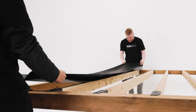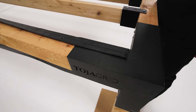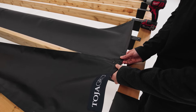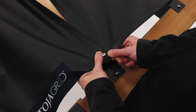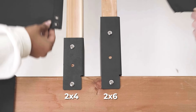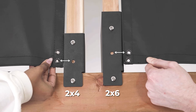We are starting with the left side panels. To fasten them, attach the corner magnets to the trio brackets and overlap the corners of the two panels, then fasten to the middle hole of the rafter bracket left open earlier. If you are using 2x4 rafter brackets, use the outside grommet hole on the panels, and for the 2x6 brackets, use the inside grommet hole so that the shades fit properly.